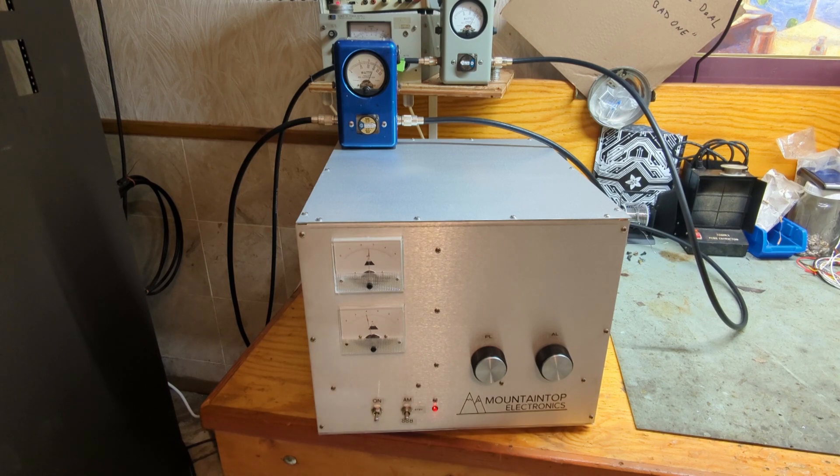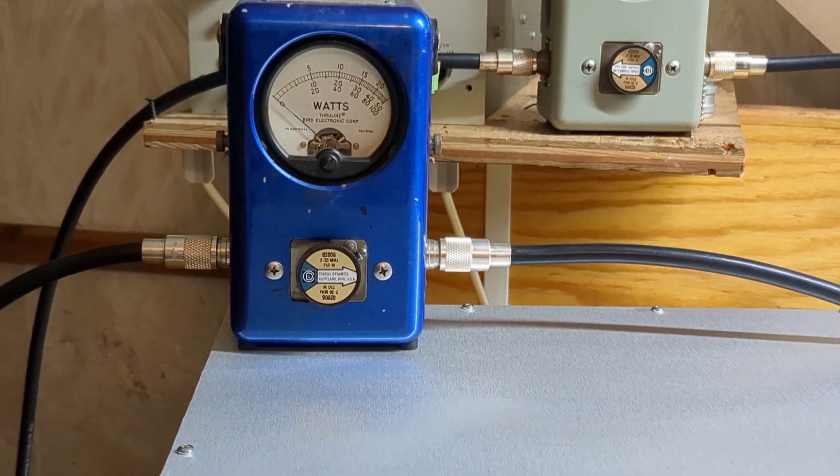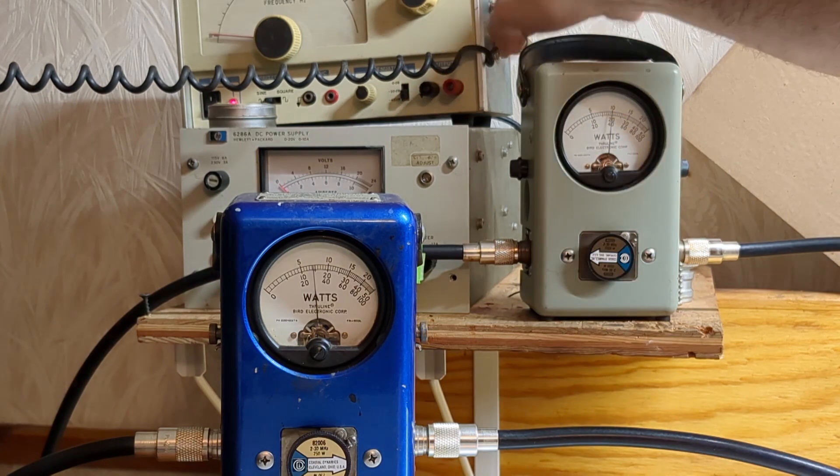That's 1700 PEP with 150 in. Now what I'd like to try is lowering the drive all the way down — let's put like 80 watts into it to simulate a stock radio or a Stryker. That's 75 watts in, giving us 1000 PEP out. If you ran the box like that it would run forever, and 75 watts is attainable nowadays — you don't even need drivers. Everybody has a Stryker or a President that does 50 or 75 watts. A nice 75-80 watt radio running into this box gets you 1000 watts, easy.